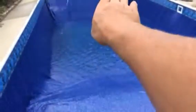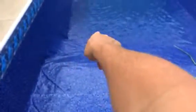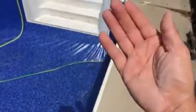Ryan said 'pull the hole inside the circle' and it worked out great. As the water is filling, I've already fallen in twice going down there to kick wrinkles and smooth the bottom out. There's a little wrinkle down here that I'm kicking this way — you can see some other wrinkles, but it won't be that big of a deal. When the water comes up about a half inch I can go down and kick those little wrinkles out. Stairs are tight but it'll stretch.